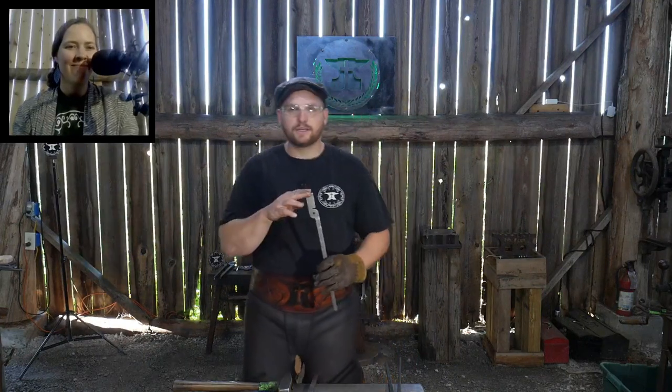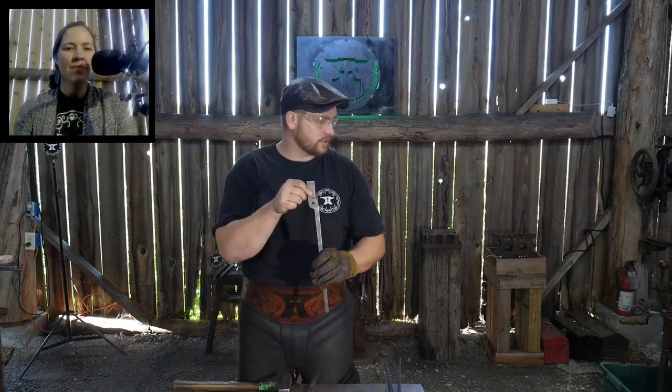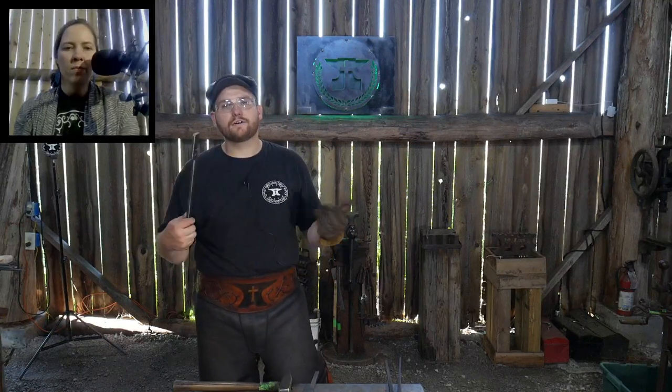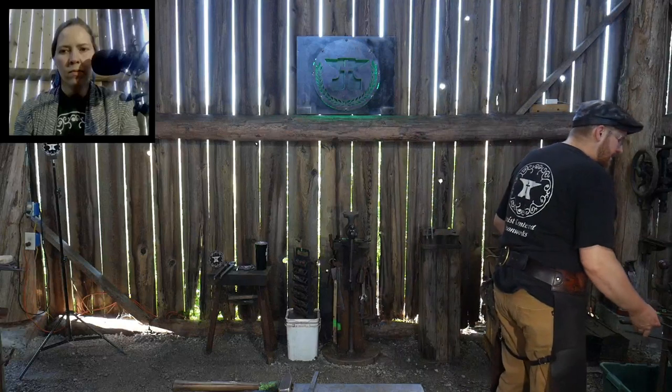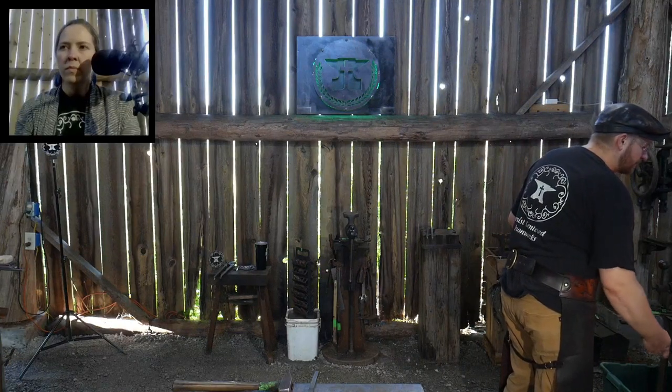Bend the tongs with other tongs. Or vise grips. You can clamp it in vise grips and go like that if you got two pairs of vise grips. Clamp it on either side of the boss and then twist it like that. That will be done in something like this. And if you get one of these twist jaw type tongs, you just clamp one end of the boss with a pair of vise grips, and you clamp the other end of the bit right there with a pair of vise grips, and then just give it a twist like that. And it's just muscle power. If you get it hot enough, it's not too difficult to do. Just by being up in free airspace, you have a little bit less leverage that way, but it still works out pretty darn good that way.